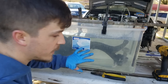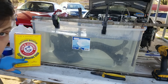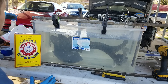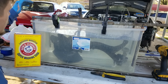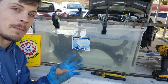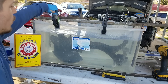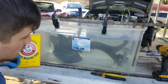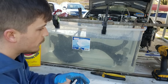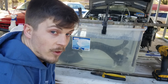So we've got our parts suspended in the solution — that's water and super washing soda. What we're going to do next is add a charge to our posts. Basically the power will go there, and then the ground will connect to our wire holding our part. If everything works correctly, we'll start seeing some bubbles form in the water and the rust will literally start to fall off. I'm really excited about this.